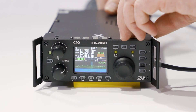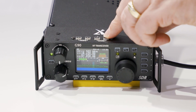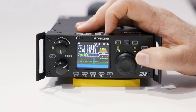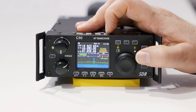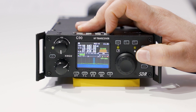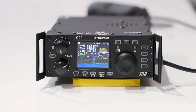We can use the band select switch here to change bands — the up and down button on the top to change bands. So we can up-select: here we're in 17 meters, and then 15 meters, which is also upper sideband — perfect. Then let's go up to 12 meters and then 10 meters as well. These are all properly aligned in upper sideband.